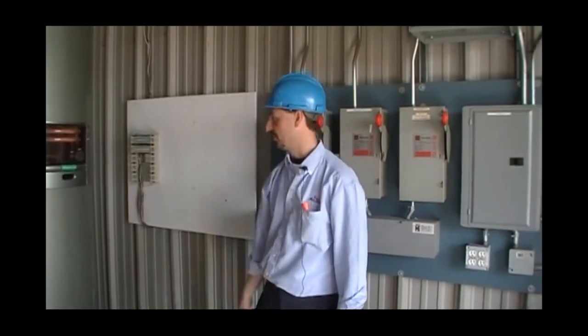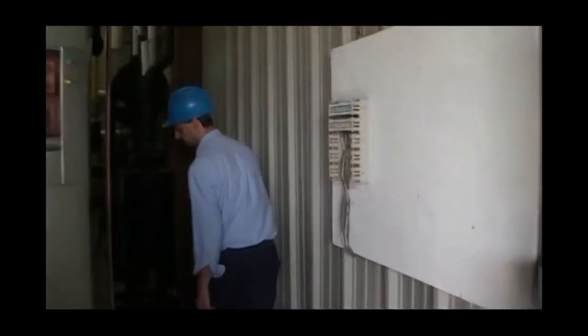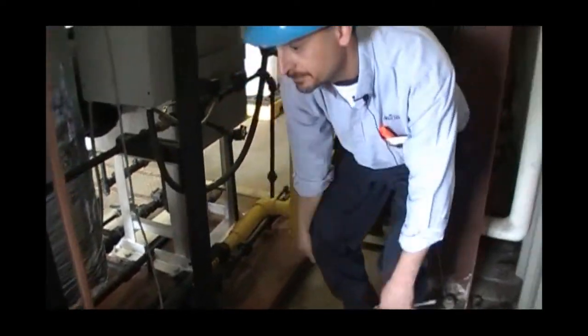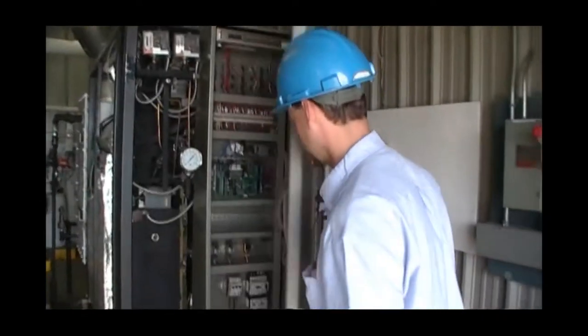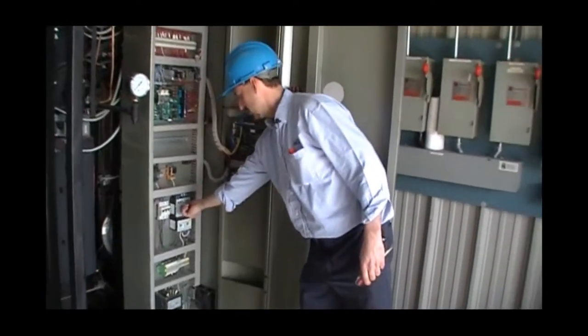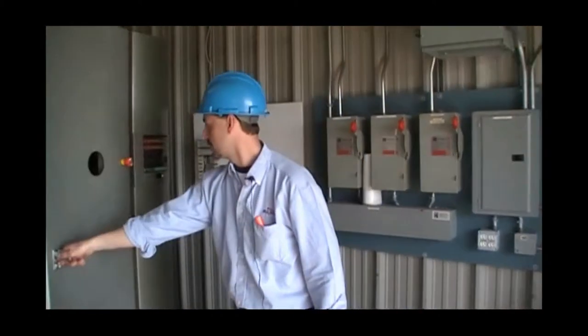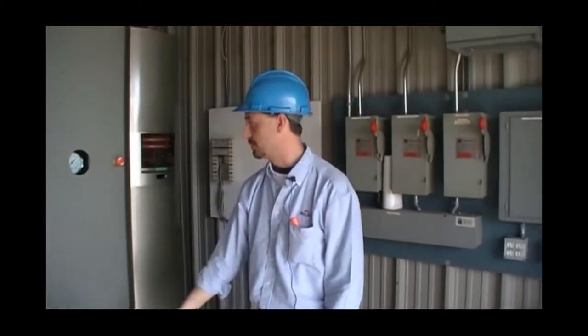After resetting the alarm condition, please close the blowdown valve. Turn the water pump breaker back on. And then you are free to proceed to the completion of your safety checks of the boiler.